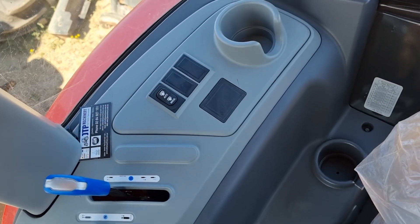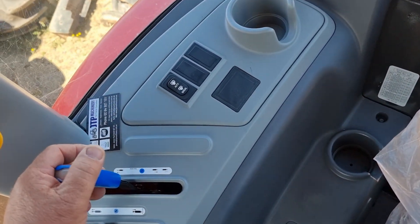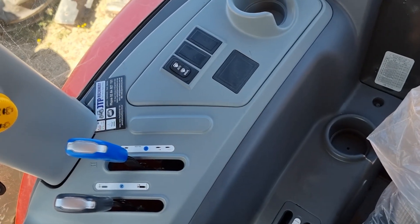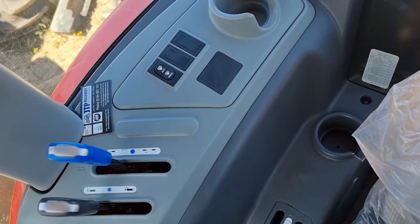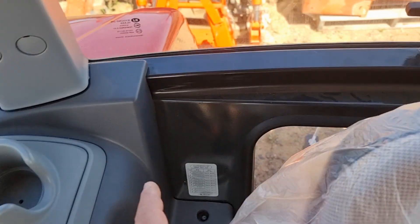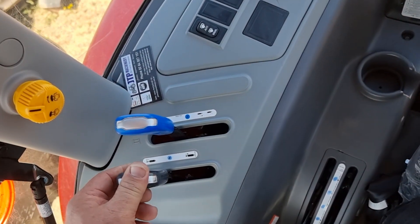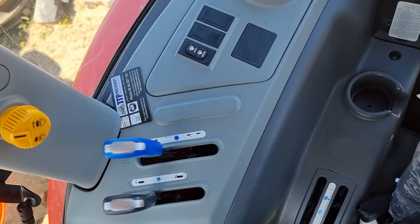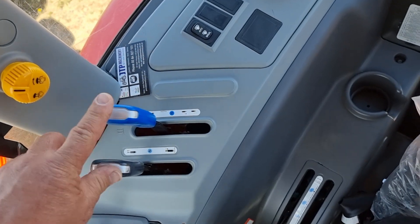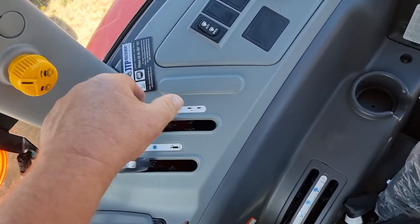It is important to have your ears trained — to be familiar with that sound of the engine loading and the hydraulic system relief valve. On any tractor you jump on, just make sure your levers are in neutral. Different tractors have levers in different spots, but it's always a similar principle — sometimes they're at the back of the tractor next to the seat, sometimes down beside the seat. You just need to identify that they are remote levers for hydraulics on the rear, how they work, what neutral is, do they have detents, do they have a float position. Once you've ascertained all of that, make sure these levers are used correctly, and most importantly, when not in use, that they're in the neutral position.